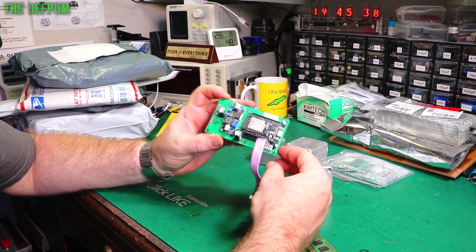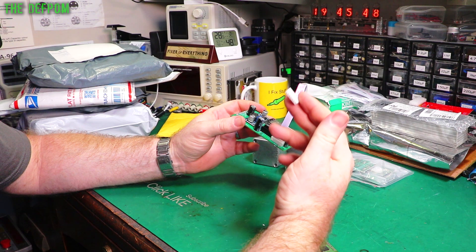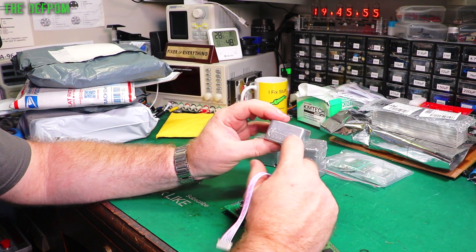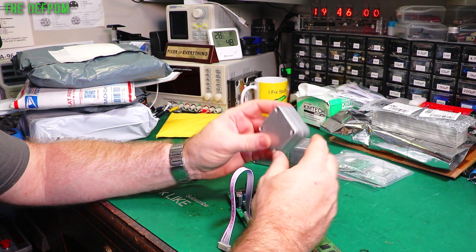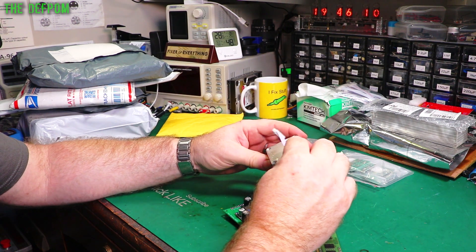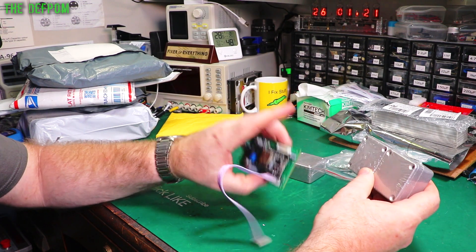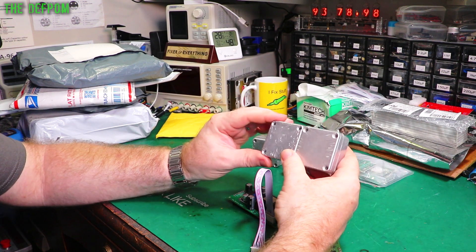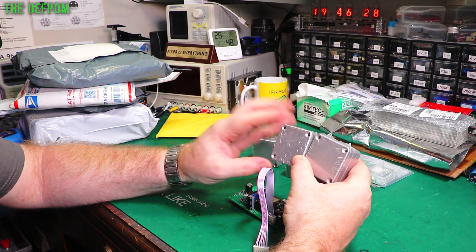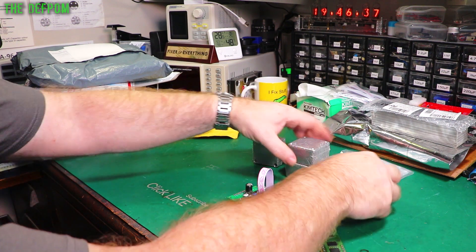This is the board I've designed — a LoRa gateway. It basically works, and I've got the display that goes with it here. This plugs into a LoRa module, and I was thinking of mounting the LoRa modules into these boxes, drilling a hole for antenna mounting with a chassis-mount SMA antenna. The LoRa modules would be completely shielded from everything else, and potentially bolt them all together since this runs two LoRa modules. I'm not settled on it yet — all I'm doing is trying to create isolation between the modules to reduce interference, as I'm running coax from the antennas up onto the roof of the vehicle.